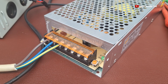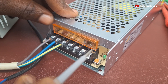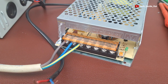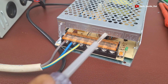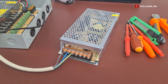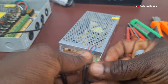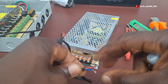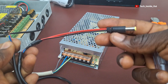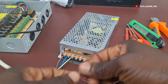When we turn on power it will come on, but we haven't fed in any CCTV camera yet. As directed, if you want to connect a camera right now, we can take a V positive and a V negative to a camera — let's try one. This cable is something I can plug into a camera, so the positive which is red will go into a V positive, and then the blue will also go into a V negative. This can then be fed into a camera to power it up.